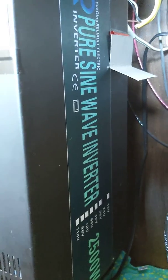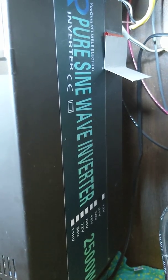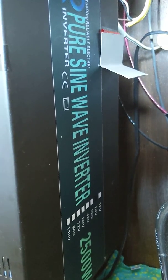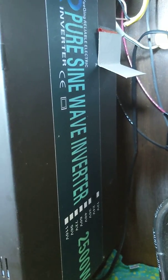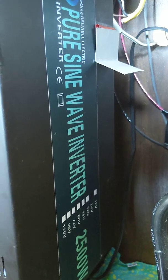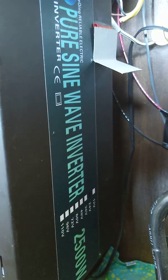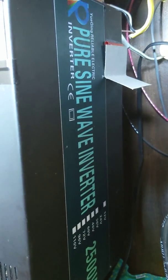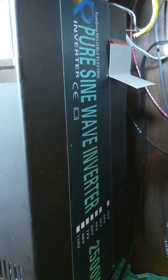It's just a matter of adding that extra box. You're basically adding a 12 volt system on top of the 24 volt one, if you will. You plug that box straight into the battery, the box steps it down to 12 volts, then from that box you'd go to your 12 volt fuse box, and then from there to whatever, your 12 volt refrigerators or fans or whatever.